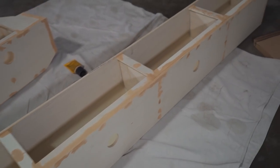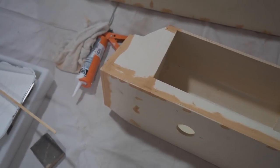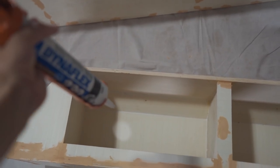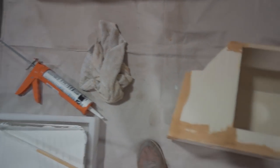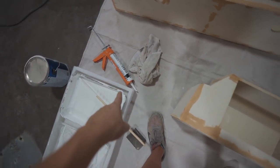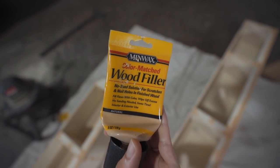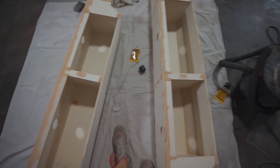Before I break to make us some lunch, I just wanted to show you guys what the cabinets are looking like. These are our uppers — I went ahead and wood filled the bottom and the sides as well. Along all the seams and cracks, I went in with this stuff — Dynaflex. That works really well; you can just squeeze it into all the seams and cracks and then take a wet rag and wipe along. No need to wood fill that. It's pretty hard to get a sander in all those areas, which is why I love using that stuff. This is the wood filler my soul loves — we only just found it this build, a little late to the game, but it's beautiful. After lunch I'll come back and sand these, just giving them time to dry.